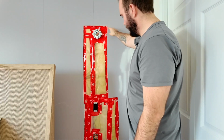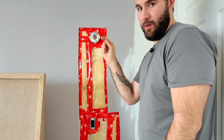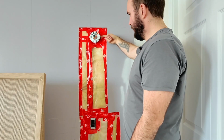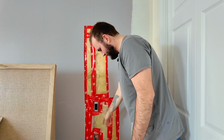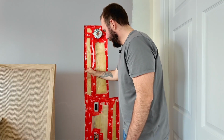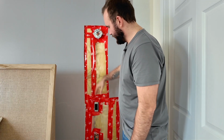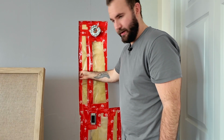It will be hidden. I'm going to cut out a bigger rectangle and replace this all in one piece. The other side, I'm going to take out a massive piece and do it all in one shot. Give myself enough room that I can drill in here, because I couldn't get this in straight, so I got to redo this. Give myself enough room to do everything I need on both sides of the stud. That way I can take the entire piece out and put in a new piece of drywall, which goes over top the stud as well, which is good, and then I'll attach it with some more 1x3s on the sides of it.